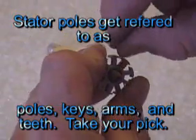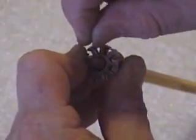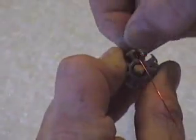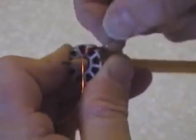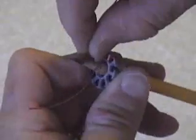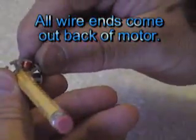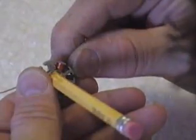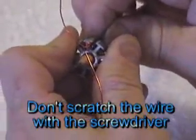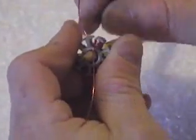So I'm going to start my second layer: one, two, three, four, five — that's seven. Now this one runs out of room — five turns, five turns. So you're just coming back down again. Five turns. Ten. That first tooth is wound. There's the back side; that'll be the front side of the motor. You can use a little screwdriver like this to push everything together to get it compacted. Sometimes I'll do that on the first row too.